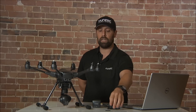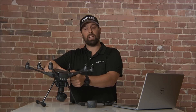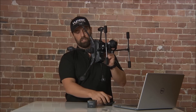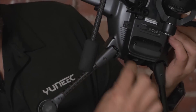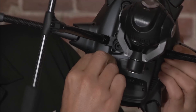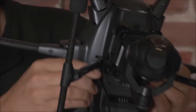In order to do that, you need your computer loaded with the Typhoon H GUI, a micro USB cable, a battery, and your Typhoon H. First, we connect the Typhoon H to our USB. Underneath the belly of the machine, right underneath the camera, there is a micro USB port. We connect our USB cable into that micro USB port.